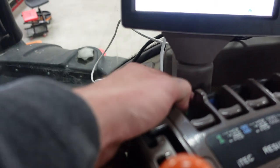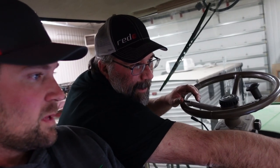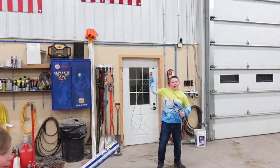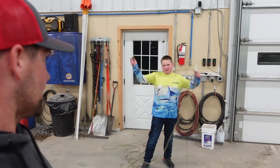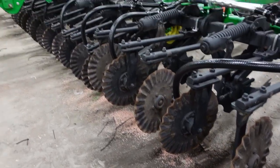Clear as mud? Yeah, me neither. Now we are going to test the blockage monitors because I'm told they will pick up some flow from that fan. Your fertilizer is going out — it was actually picking up the little bit of fertilizer that was still left in the tubes on the actual rig itself that I didn't have enough air pressure to blow out before, so it's pushing fertilizer through. There's the fertilizer I left in the tubes. Now they're clear.